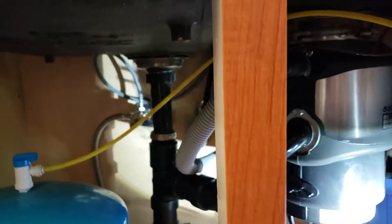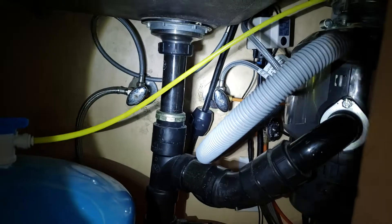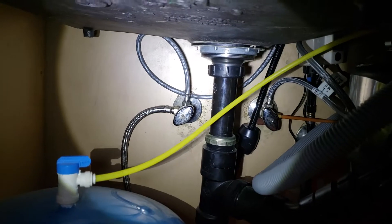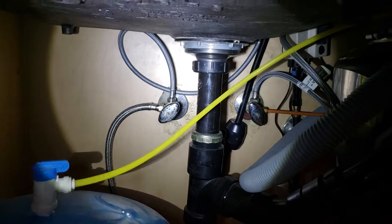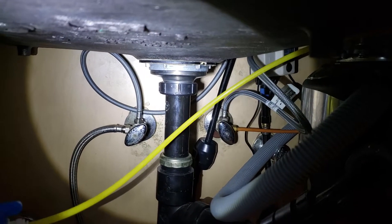We've tested it. A couple of the shutoff valves — which are not ours — especially the cold one when we turned it back on, it sprayed everywhere. So we got the packing nut tightened down and it's good. Monitor this area down here in the back. All of those connections, the shutoff valves — these are new points of connection from the faucet because those supply lines are integrated, so those are good.